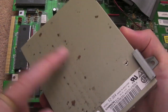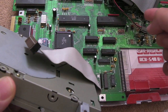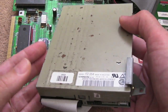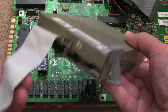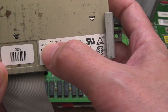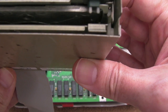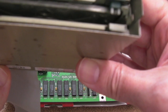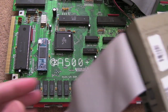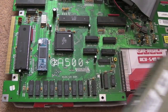So here's the drive - a little bit of corrosion. One thought did cross my mind just opening this: we might find this works and it might be flawless. If it does, he's going to have leaking caps in his 1200 - that is not out of the realms of possibility. This is a Chinon FZ354. I think I might have looked at this model previously on my channel. We'll connect this up to the 500 Plus here - obviously I'll power it off first. I'll disconnect his ribbon and just use the one I've got.